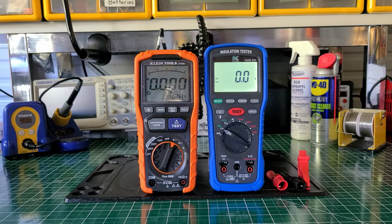And that's the AC/DC voltage. The earth-bound resistance measurement, they say at 20 ohms, you get 0.01 ohm. At 200 ohms, you get 0.1 ohm. Oh, the first one had it wrong, they had 20 ohms, sorry, for 0.01 ohms. The next one would be 2,000 ohms, 1 ohm. And 20,000 ohms would be 0.01 kilo ohm.